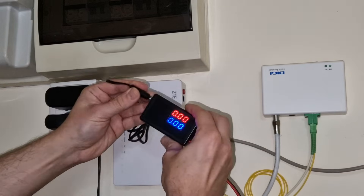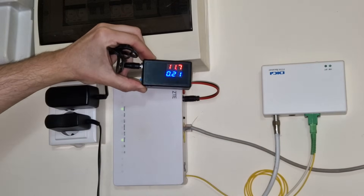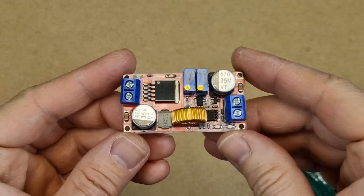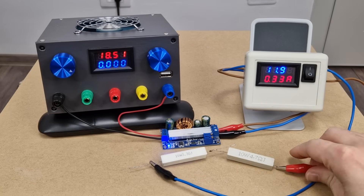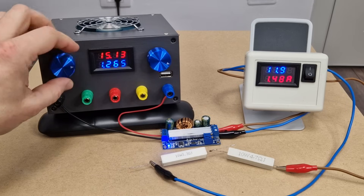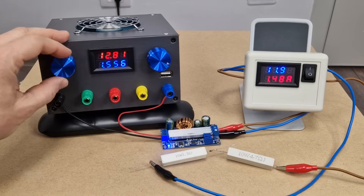The optical network terminal is next. It has a 12V charger; after turning it on, we have to wait a few seconds for the internet connection to be re-established. The internet LED lights up and we have a current consumption of maximum 250mA. I cannot use a step-down converter for the 12V output, because the input voltage can drop below 12V when the battery is discharging. So we need a buck-boost converter that can maintain a stable 12V output whether powered by the 18.5V charger, the nominal battery voltage of 12.8V, or even when the battery is discharged to 10V.